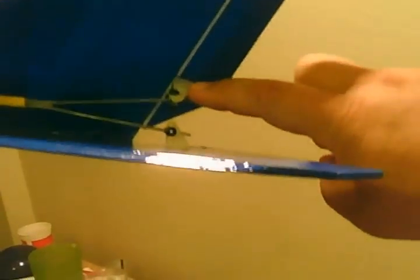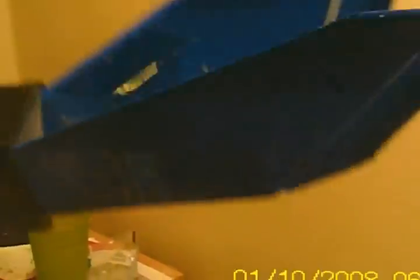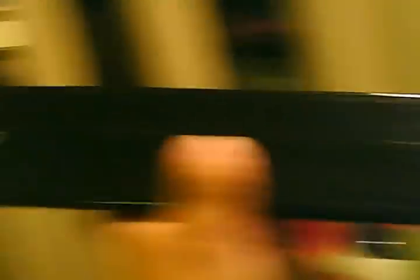Here are our elevators — up and down, nice and strong, good articulation. Because of the angle, I did make a little bit of an angle on this elevator, just because that would look cool. The important thing is getting the angle right on the direction that this servo horn faces. If you aren't good with your math or can't get the angle right, it's probably best to just make it straight. That way, as the push rod goes back and forth and the elevators articulate up and down, you don't get binding. I'm almost on the bind, but I got it pretty good — it works pretty well.